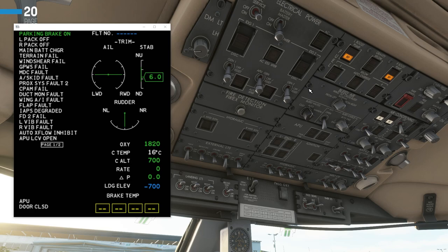The next panel to check is the bleed air panel. We're going to make sure the wing anti-ice cross-bleed switch is set to normal, the bleed valves are set to auto, and we're going to turn the isolation valve to on. We shall also leave the bleed source to both engines. I recommend having a quick read through what each of these switches does in the manual, as it's quite useful to know why we have these in these positions.